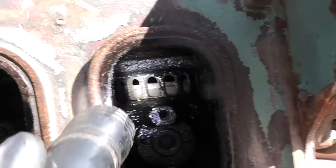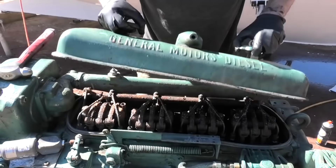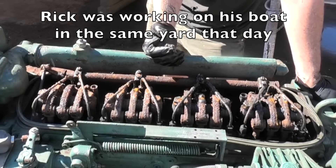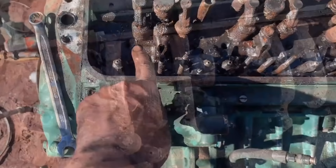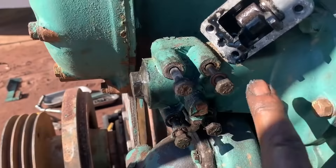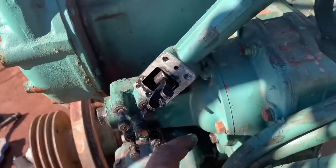Chunky. Yeah, I think this has all got to come apart. I'd be surprised if those rings weren't seized on that one. I don't know why I've got so much water in it. It wouldn't get in through here — you wouldn't think it would go through the gasket. It's got the breather but that's too much for going through the breather. The rocker assemblies are off to get to these bolts, so undo these and we'll get it apart. Wound all the rockers off the push rods. Now I'm just undoing these bolts for the governor, then I think we might be down to the main head bolts after that. Undid two bolts at the bottom here, four down here, and then there's a fork here that goes up to the governor — actuates it in some way. I don't really know how it works but it's now out of the way.